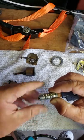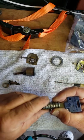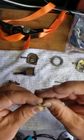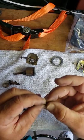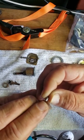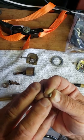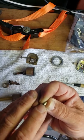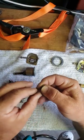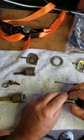Normally a lock's key pins are vertical but this one is sitting on a horizontal plane. We're going to take this pin out and show you exactly what these pins do. Here's the pin - this is the bottom of the pin, this is what goes up against the key. This other center pin: as the key is drilled for the outer position, there's a peak on the center of the key that rides on this pin here. So if it's not exactly drilled for the upper and the lower pin, you're going to have a problem. You can see how that pin stays up just like that, and now everything together is flush - that's what operates the key to turn.